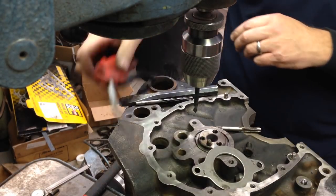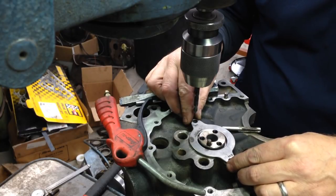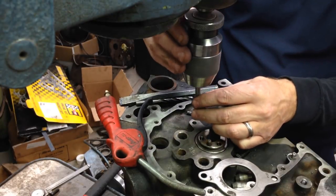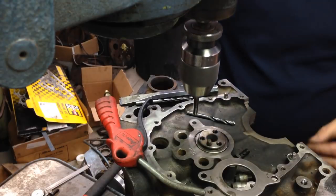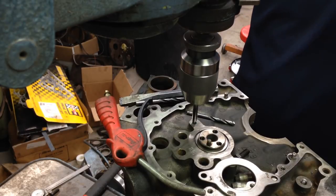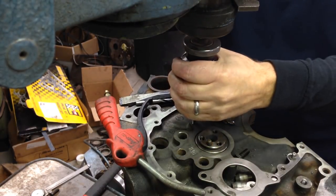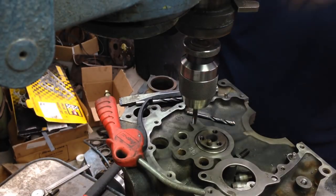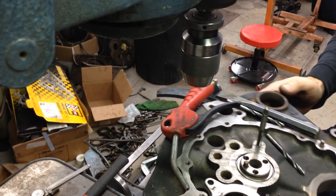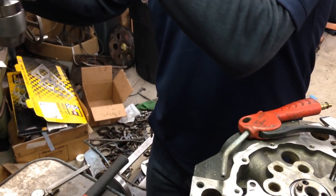Let's get our tap in there. Let's place it in here and see what we look like — oh, that's beautiful, that looks really good. I like to start the tap with the drill press. I don't want to run it all the way down with the press, but I like to start it just because it gets it nice and straight. I'm not brave enough to run the tap in there with the drill press — I'm afraid I'm going to break it. Just get us started, and now our tap is nice and straight and we can get the tap handle and take over.